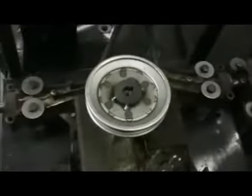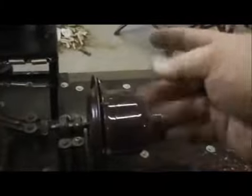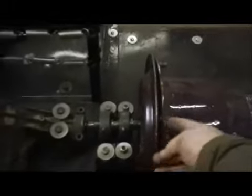But anyway, so I told you guys I'd run this splitter, and today I went out and I got a 5-inch pulley, and this was spinning a little, so I shimmed her out. I guess this plate warped when I welded it, so I shimmed this plate out on this bolt and this bolt, 2 washers each, and I got no washers over here. I got 3 bolts in it, 2 on this side, 1 over there, holding it on, which is sufficient. I might stick 1 washer in here if it's the proper width on each side and put those bolts in as well, but 3 bolts really holds it good.